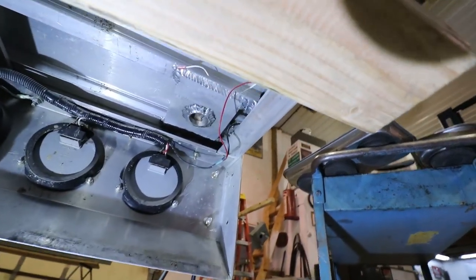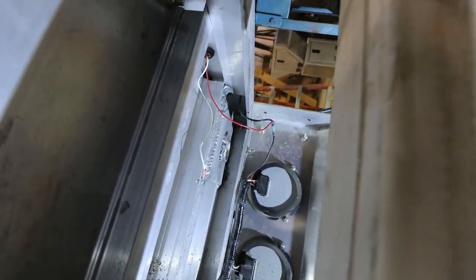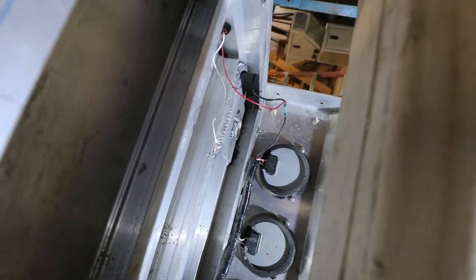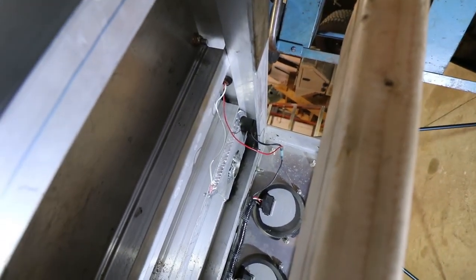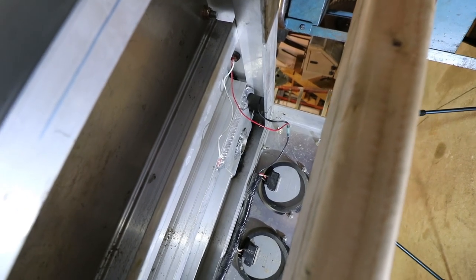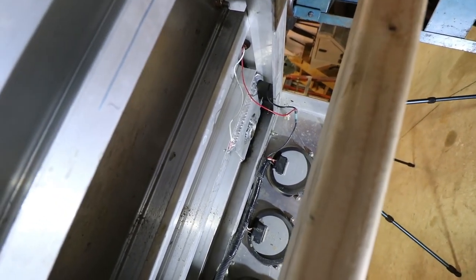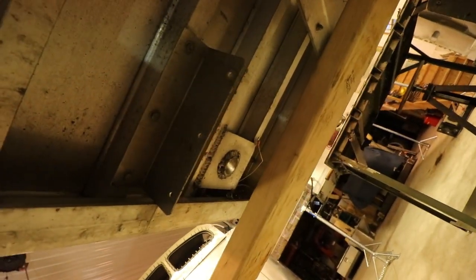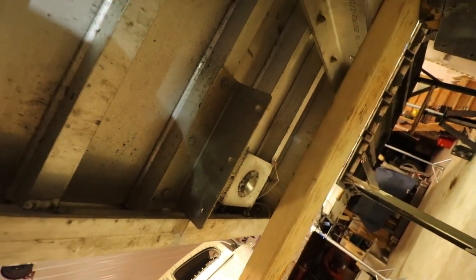All right, down here at this end, I don't know if you can see, let me turn the camera sideways. First thing I do is drill out that ground up the top and cut the wire to separate the lights that are in this side panel, so I can take that side panel off. And I'll bolt that ground back on later on. It's only riveted on right now. There's probably one up in the front here too. Yep. Have to take that one out too.